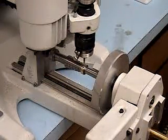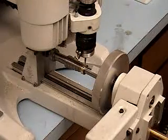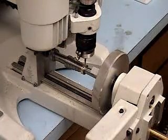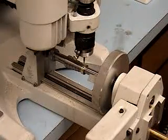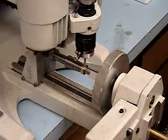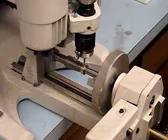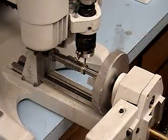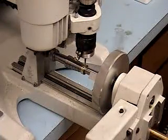This video shows the IS-400 engraving machine engraving the outside diameter of a ring held on a ring sliding mandrel and a cylindrical attachment. We're using a conical cutter with a 0.2mm point size and about a 13 degree side angle to do the engraving.